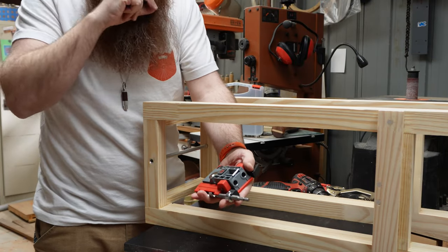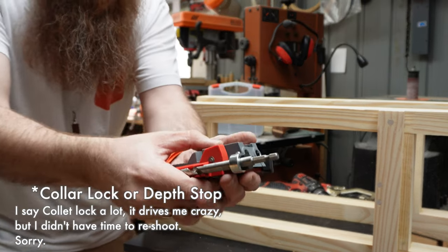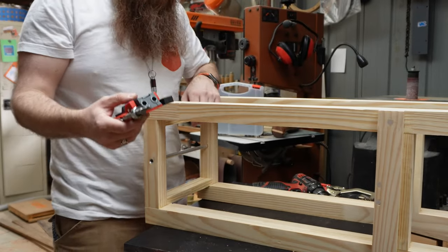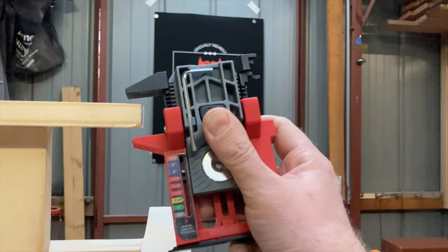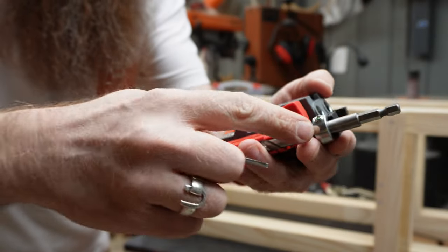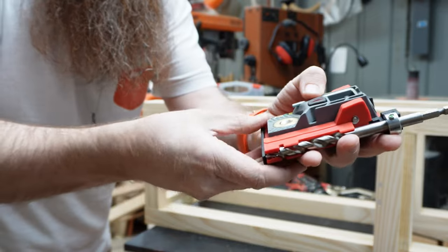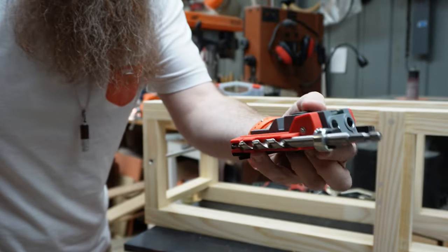Similar to the regular Armor Tool jig, the collar slides up and down as you adjust the depth. These caliper jaws you simply attach to whatever you're drilling through — thusly, clink. You tighten up that grub screw which tightens down to the bit, then you put the Allen key back in the carriage. Flip the stop around that way and you're good to go.